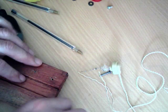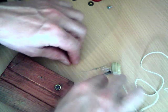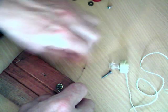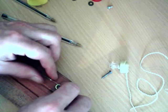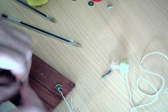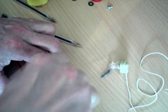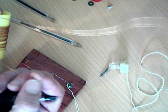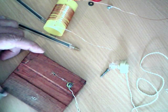We're going to start by putting the screws and washers into the baseboard, just loosely like that. The idea is that the wires go underneath the washer — they're trapped underneath the washer, and that gives you your connection. This connection here is a connection between the diode and one wire of the earphone — the top right in the circuit diagram. Don't forget to scrape off the enamel at the end of the wire so you get a good connection. We'll carry on going round the circuit in that fashion and make all the connections on the circuit diagram.